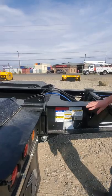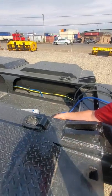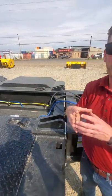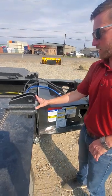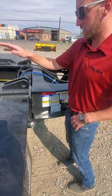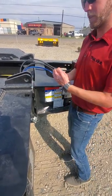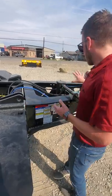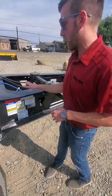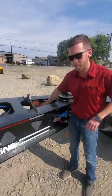Your air booster here — all of your connections are on the inside box. There's also a remote tank drain. If you know the trailer's going to sit for quite a while, you can crack that tank drain valve to make sure the air tanks drain so you don't get condensation and rust in the steel tanks. The connection point here is your shimmable air booster. This right now has the thin gauge shim in here. When you're empty, typically you'll have no shims at all. When you're loaded, to get the most weight back here, most often you'll have just the one thick shim.